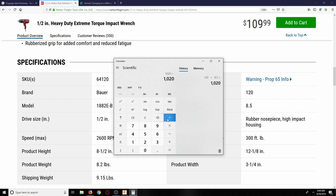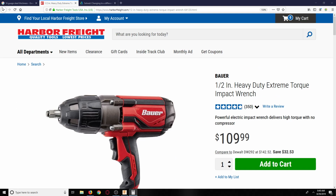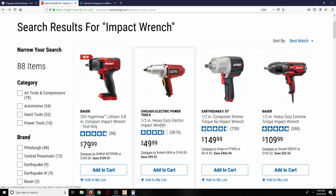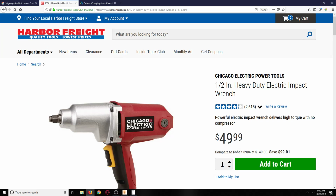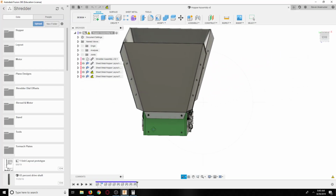That's 1,020 watts divided by 750 watts per horsepower. That's about a horsepower and a half. So that's kind of what I was looking at. Obviously not a $100 motor, preferably. And you can see that size is completely usable. Because again, the idea is that I want it to be about this size, about six and a half inches long, and with the head sticking out.